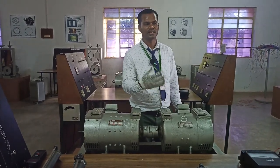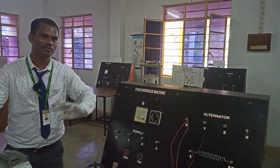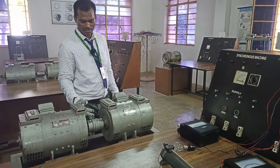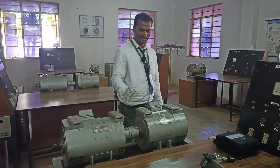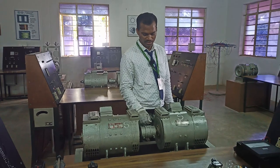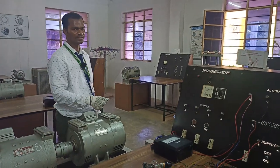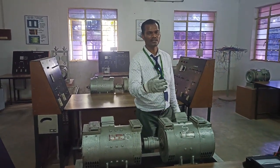These alternators are also used in electric vehicle applications in the regenerative mode of operation. You may be confused because here it acts like an alternator, but the same motor will also act like a synchronous motor depending on the input you give. If you give mechanical input and excite the field or use a permanent magnet, an EMF is generated. If you give supply to the field winding as well as the armature winding, it will act like a motor. In accelerating mode, supplying the rotor and stator makes it act like a synchronous motor. In de-accelerating mode, the rotor freely rotates as the vehicle decelerates, and since the rotor is an electromagnet or permanent magnet, EMF is generated. Thank you for watching.